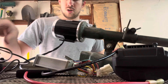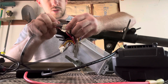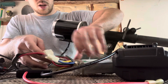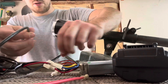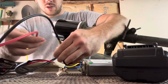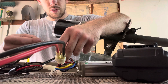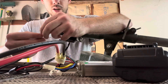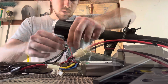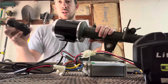To hook this up: take the motor red to blue, blue; and I'll take black to yellow. Then we have our power supply — black to black and red to red. Then hook up the throttle — luckily the colors just matched. Everything is hooked up, should be good. We've got our thumb throttle.